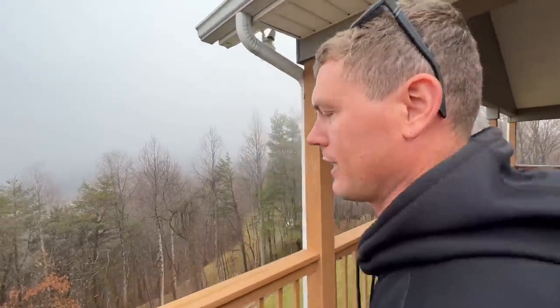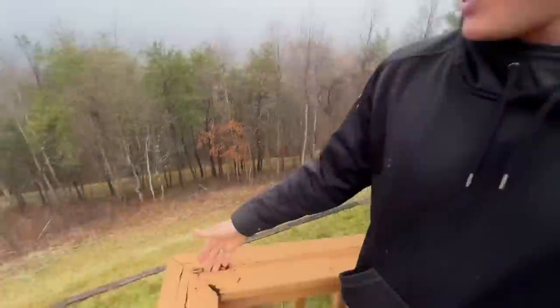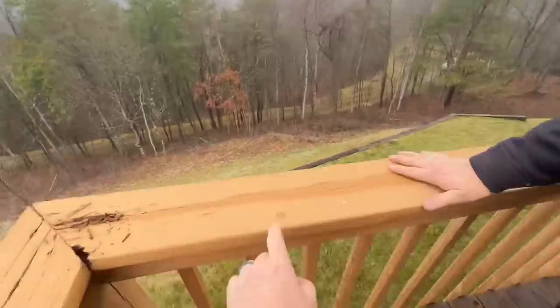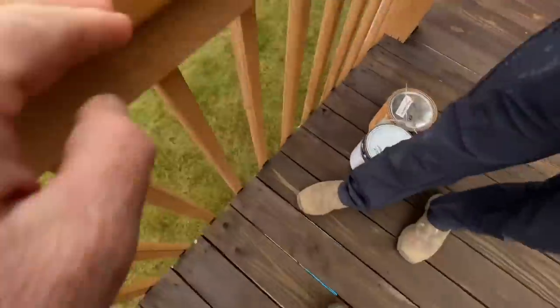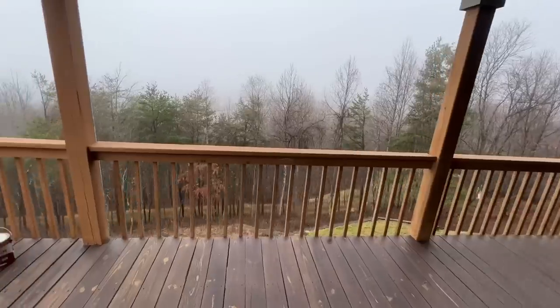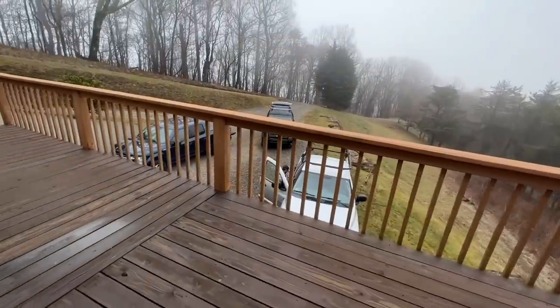These top caps, we realized, are actually spruce material. That's like interior framing material that got used. How did you figure that out? Well, a couple things. First of all, this spot right here was kind of a giveaway. That does not look like treated wood. You can tell right away by the grain and by the size of the knots that this is not yellow pine. Yellow pine is the kind of wood they use for treated wood. Spruce has these little knots and a smoother grain, whereas yellow pine has big knots. They probably figured that painting it up real good would keep it protected from the weather. On the areas under the roof, it's actually in good shape. Out here where it gets rained on every time it rains, it's not fine. And we're going to replace it with treated wood.